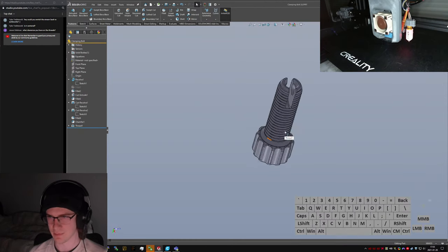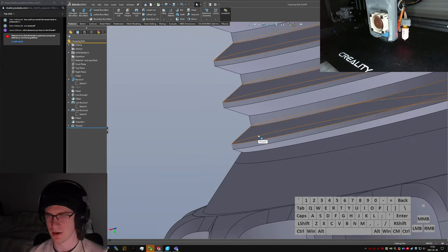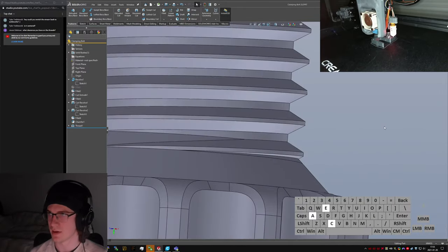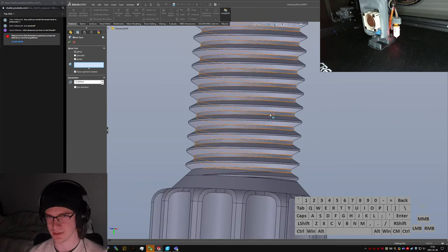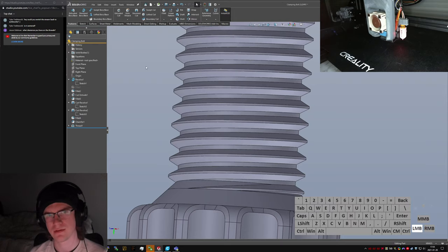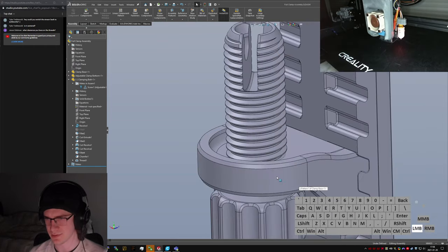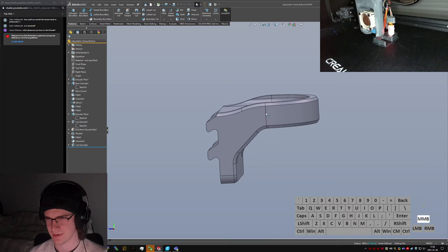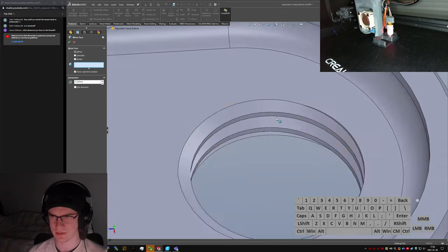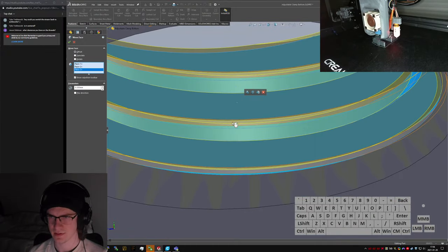is I will take 0.1 millimeters off of all the faces on each side. So just do that. And I'm now realizing that I'm going to have to do that to all those ones up there too, but price you pay. Well, hang on. I could save myself some thinking and just do it on this part instead. And then I don't have to select quite so many faces. And this has more meat on it anyway, so. I like to have 0.2 face-to-face clearance. I've found that that works pretty well.